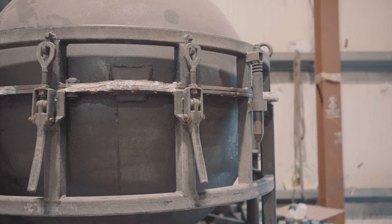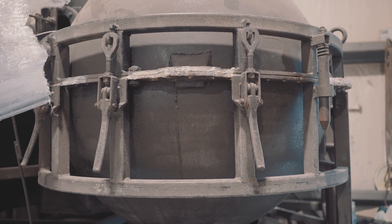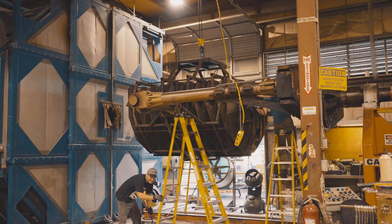Because roto molding is a low pressure system, creating the molds is a lot easier compared to injection molding. They require less fine tuning and less labor overall. Therefore, the initial cost to start up with your roto molded product is much less. That being said, the unit cost is much higher to produce because roto molding is a lot slower than injection molding in terms of per unit, and it requires more labor. This is not usually a problem though, because we are talking about large plastic products like kayaks, and you're not usually concerned with pumping out a million kayaks per minute. Generally the demand for these types of products is not as high in terms of unit numbers.